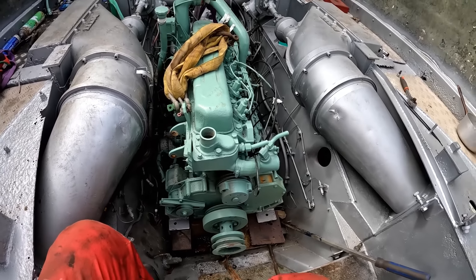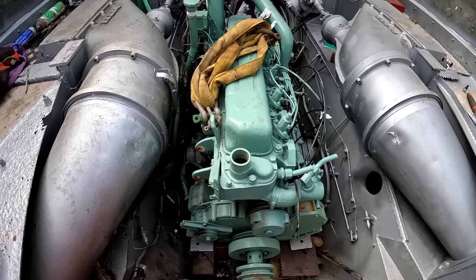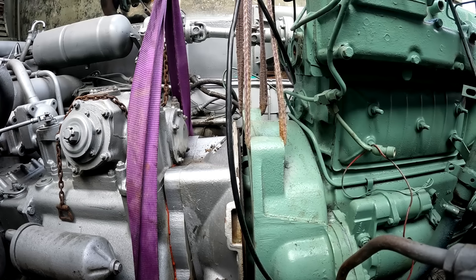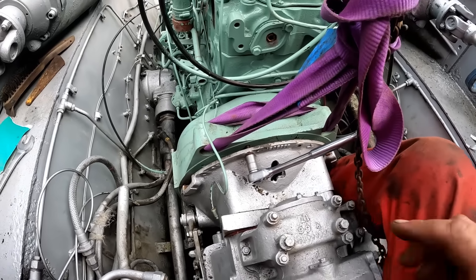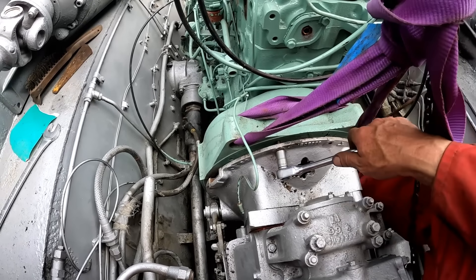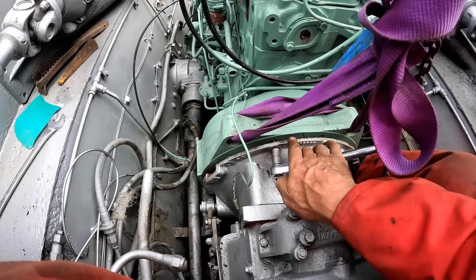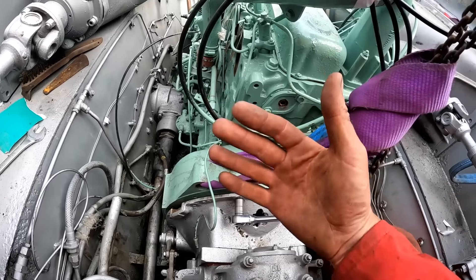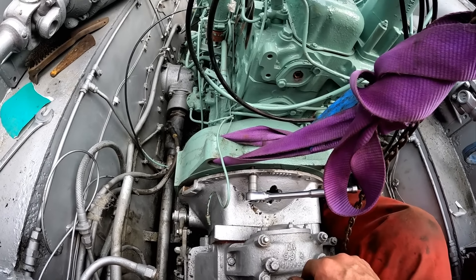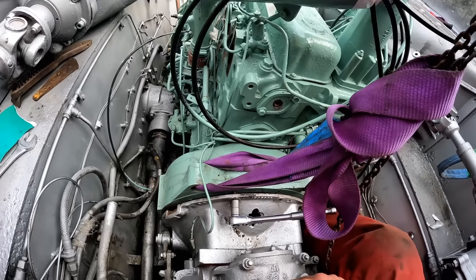Just giving it a little bar now. I'm doing the final tightening using these bell housing bolts to actually pull the engine up — it's a very small gap. I know the spline shaft is engaged and I'm just tightening these up; it's drawing the whole engine back where it needs to be, and then hopefully those rear engine mounts should line up as well.